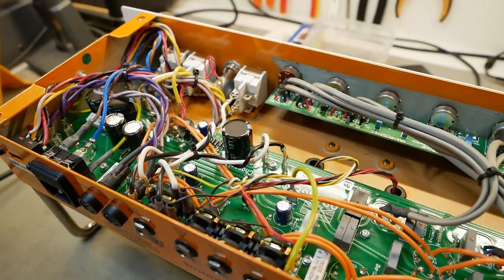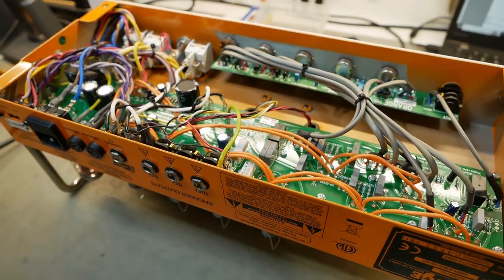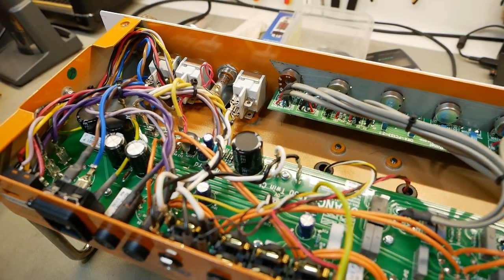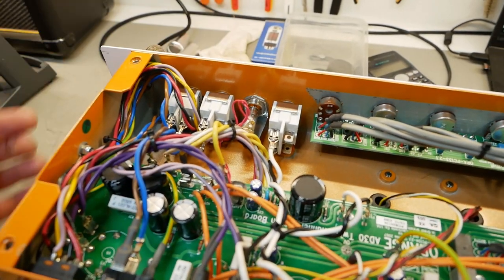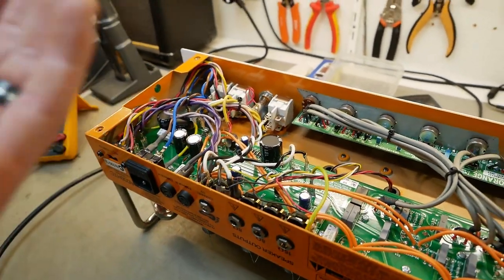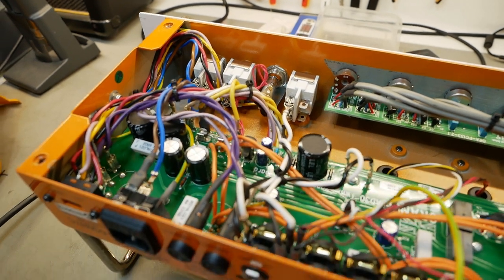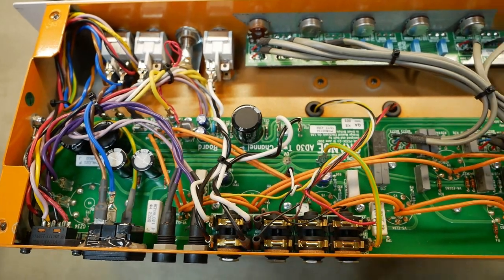which is what happened here. So if you've got an AD30 and several other amps, like some of the AC30s, you don't want to use the standby switch. Just leave it always on. And then when you turn on the mains, the valves are cold, they'll slowly open up and start conducting in a controlled manner, and you won't get that inrush that smashes the hell out of the poor little rectifier valve down there. So that was the main cause of our woes.